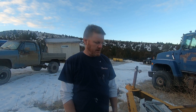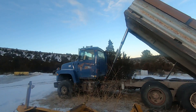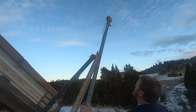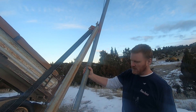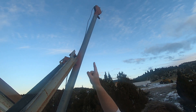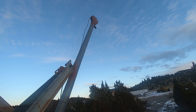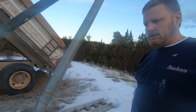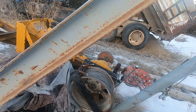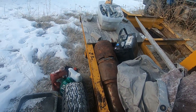We might resurrect this thing and put another motor on it — I've been wanting to do another well, and this thing was really cheap to build; everything was salvaged. This boom we just made out of a piece of two-inch pipe and reinforced it. The pulley was quite a thing of contention — we went through several before we found one robust enough. We wound up actually making that pulley and putting a bronze bushing in it; ball bearings weren't quite strong enough with all the force. Anyway, that's a rundown of this little machine and I'm quite proud of it. I hope that gives you guys some ideas — thanks a lot.